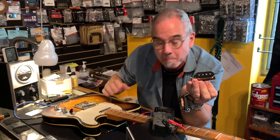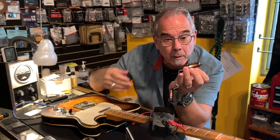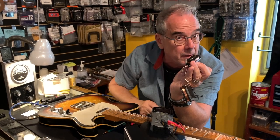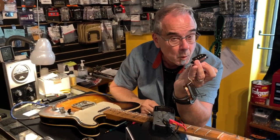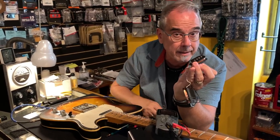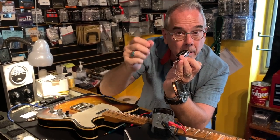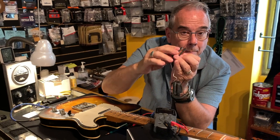To make a good pickup, these slugs themselves — your pole pieces — are magnets. And how they're made: nickel, aluminum, cobalt — the more cobalt that's in the mix, the softer the magnetic field will be. As the string waves over the magnetic field, with a nice soft Alnico magnet, it's allowed to freely go back and forth over the pickup without the pull of a strong magnetic pull.